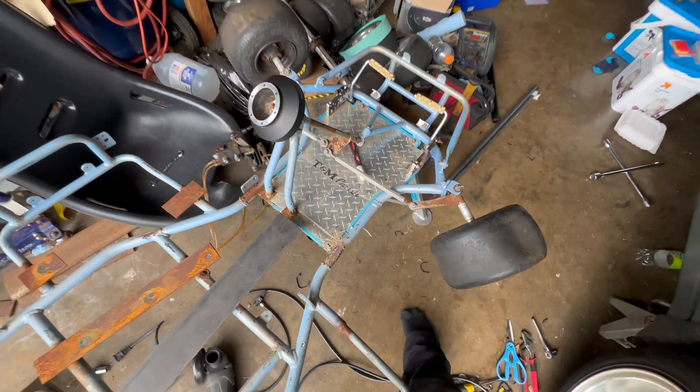The other thing we're going to figure out is the angle for the go-kart. Being that it's flat like this, that's the max angle I can get, and that's not enough for what I need. My plan is to weld a rod that comes out a bit so the cart can get more angle. I'm going to have a pipe there and then a flat piece for it to bolt to — or I might just weld the piece right on, which would be ideal. I made these pieces which are going to be welded straight on, and the plate for the wheels will weld straight to that. They're about three inches wide with a 45-degree angle on one side and a 10-degree angle on the other.